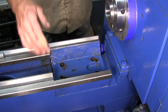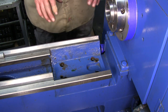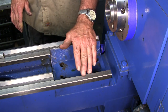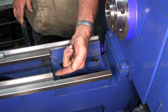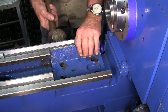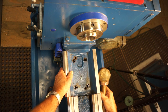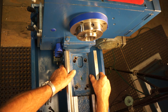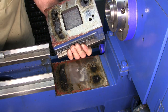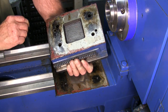There's no doubt when I remove this we're probably going to have to sand or fix some kind of edge along there on both sides. We need to have it so the metal is going down here and it sits up against the ways. Most of them have another secondary screw that draws it in, just like on the Clausing out there. Here we go, we're going to pop this loose — let me tap up on this back side here first. That's all it took.